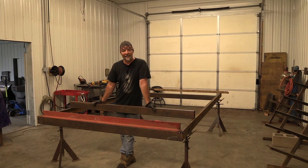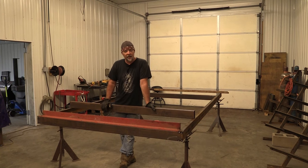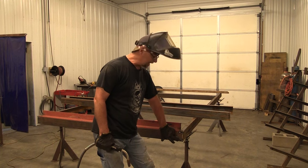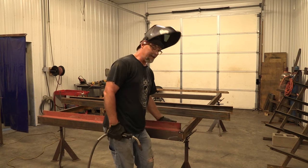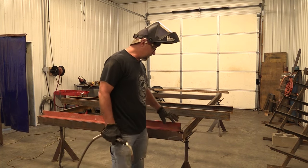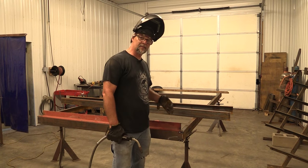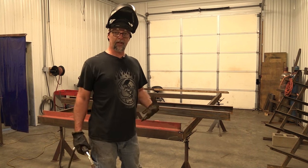When we're ready to actually set that cook chamber on this trailer, that's when we're going to decide where this goes. So I'm going to get this out of the way, get the beams for the tongue in here, and we're going to start working on laying those out. I'm going to go ahead and weld around this spot where this channel and the tubing meets, and then weld the backside of that. When I get the front and backside of this channel and tube welded together on both corners, then I'm going to cut this brace out of the way so I can weld the top cord on both sides. And once I get that done, we can start working on the tongue of the trailer.